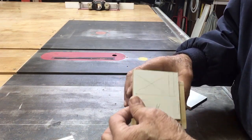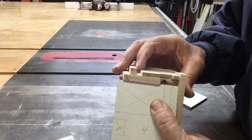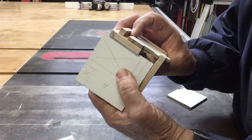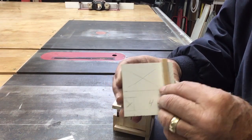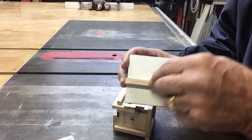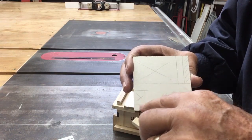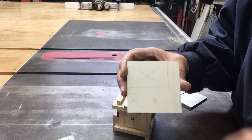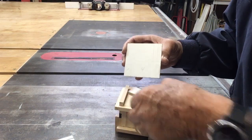And then your tab line here, put like this, and you have your number 5 in here. Number 5 pulled up, and you can see where to mark it. Hopefully you can see that. That's where your tab is. So you draw your tab line. I like my rails, I use a rail thickness. Then across this line that you just did, again, I use the rail thickness, mark the bottom, that mark and this mark. I go on the bottom, mark and mark. Then here I'll come in like an eighth of an inch. And then this again, like I said, you go 1 inch down from the top, roughly, and come in so that it clears.